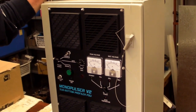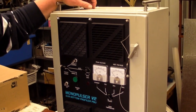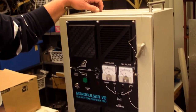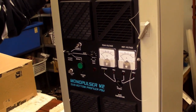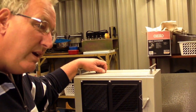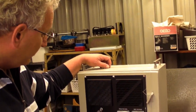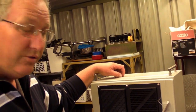Let's go for an overview. What have we got here, Doug? This is a rather nasty capacitive discharge power supply. It's designed for doing ocean bottom profiling. Its principle is to charge up a rather large capacitor to anything up to about 4.2, 4.3 kilovolts, and then discharge it through SCRs into the load.